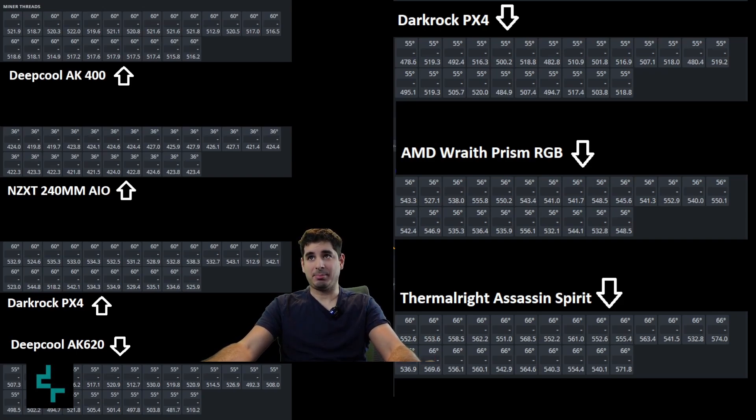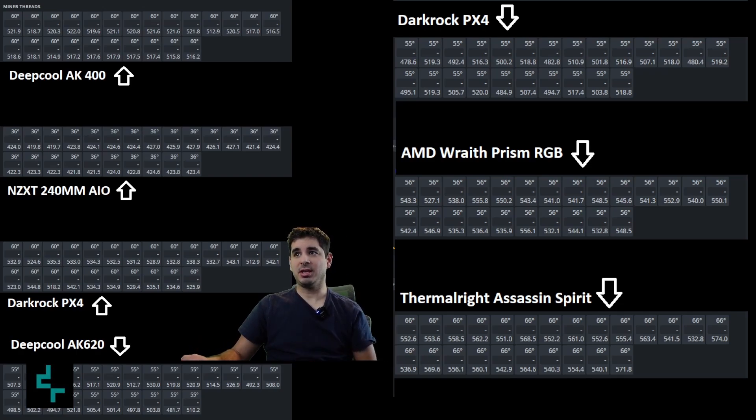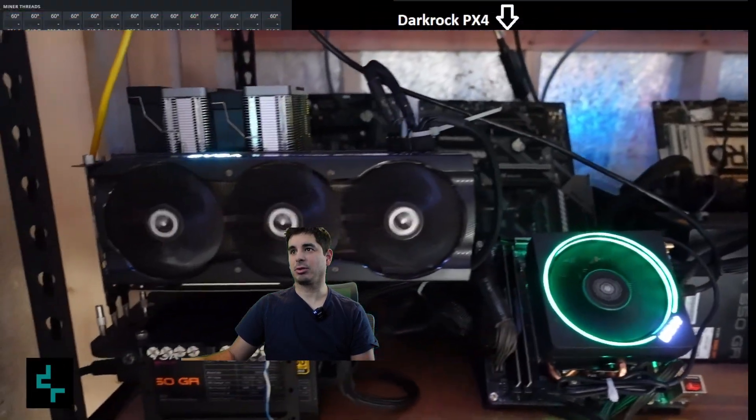Now I want to do a more in-depth hotbox test and let it run for a bit to get real temperatures. These are all pre-hotbox readings. The ones on the left are in the back row and the ones on the right are in the front row, so you may notice a few degrees difference. When I hotbox, I'll cut off airflow in the shed for about 30 to 40 minutes to simulate summer — though in summer there will still be some airflow moving. For anyone not aware, this won't be an exact test: to keep devices cool, you can either cool the air or speed up the air, and it's a lot better to speed up the air.